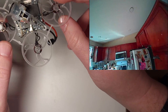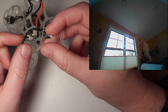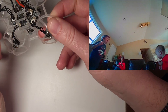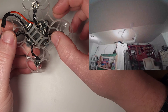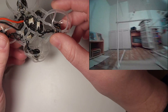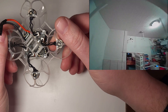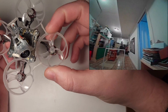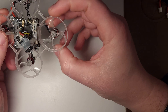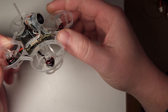Other than that it's basically a standard HD Zero VTX — you've got the Divimath chip here and the other Divimath chip we see on all the VTXs. Missing from this is the MIPI interface chip, because it's not needed anymore. On the bottom we have motor plugs, so if you wanted to experiment with a different KV or shave some weight, you could do that easily. I saw someone on Facebook — I think it was Anthony Knight — who got this down from 23 grams to about 20 grams by removing the motor plugs and using nylon screws instead of metal ones.